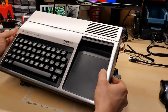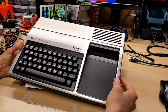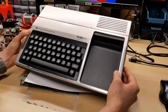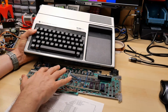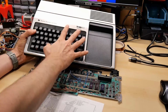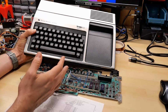So I have gone into the office where I had some of my retro computers and I picked up my Ti99 4A silver version, and this computer works. Well, it should work at least. So I'm going to use this to help troubleshoot this problem by taking some of the chips off of this motherboard here that's not working, and at least I can confirm for sure whether the graphics chip works or doesn't work and the GROMs work or don't work in this. And I might go as far as to socket some of the chips in this machine so I can test the SRAM chips in here, for instance, but we'll see if it comes to that.